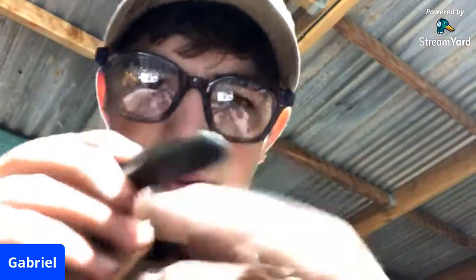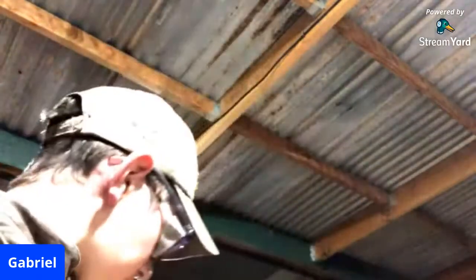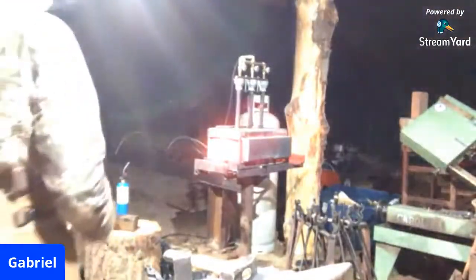As you look down there, it's a rectangular punch, which then spreads quite smoothly and gradually down to the main half-inch shank, and then the head is rounded down, so as you are hammering on it and using it, it does not get mushroomed over, because it is going to get soft up here, because we are going to temper it, and we're going to run the colors down. So, that's what we're going to be doing next. So I'm going to slow the forge.